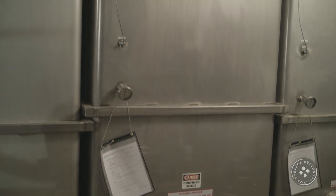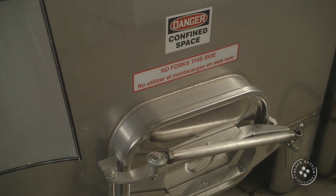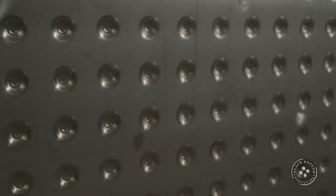Welcome to our fermentation bay, home of our six 750-gallon stainless steel fermenters. After we've moved the mash into the fermenter, we'll add our yeast, and they'll work for five days to convert those sugars into alcohol. As they do this, they'll create waste heat and CO2. That CO2 will off-gas into the room, make the distillers a little loopy, and we'll whisk that heat away by running cold water through dimpled jackets on the back.